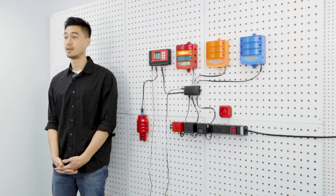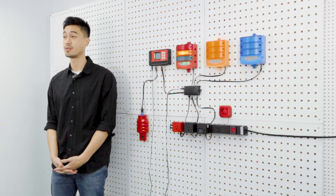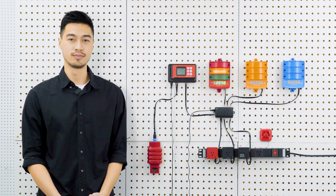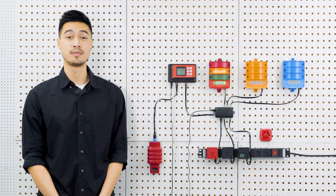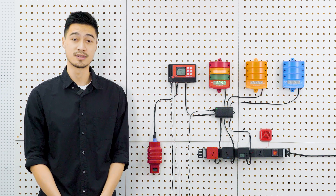Many customers want to know if they need a CarbonX or if they can just use their HydroX or X-Pro controller to act as a CO2 alarm. The short answer is no. Regulations require that any CO2 safety system must have its own CO2 sensors and be a standalone controller in order to provide redundant CO2 sensing and protection in enclosed spaces.